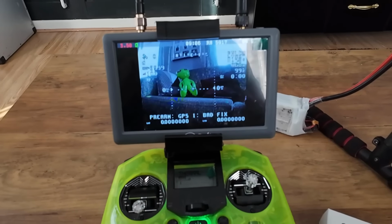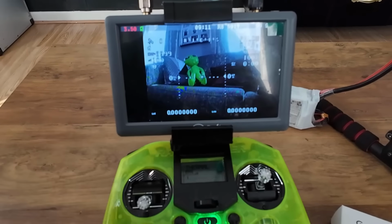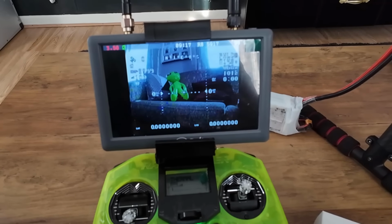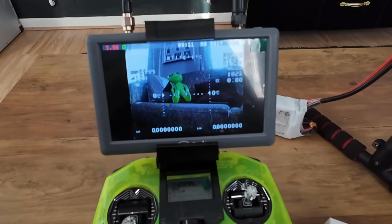It's not an optical zoom, it is a digital zoom. So I've got a 3-position switch enabled on the back of my radio because it can do 3 times digital zoom. Position 1 is normal zoom, position 2 on the switch would be 2 times zoom, and position 3 would be 3 times zoom.